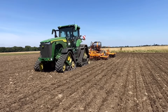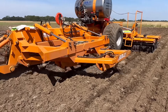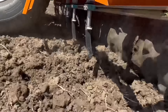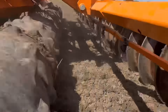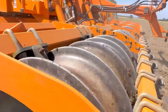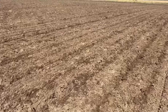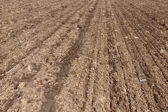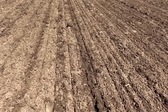So Tom's putting in this winter bird food mix. Still wet underneath, looking at the soil coming up. You can see the seed coming out of those tubes, dropping into the groove that the leg's made. And then the fertiliser is also going in the same groove, right above the seed. Then we follow with the roll at the back to roll and firm it. You can see the legs bring moisture up — that's where a leg's been — so that's why it works really well, because the seed is going exactly where the leg's been.